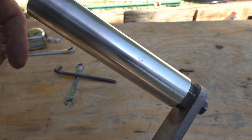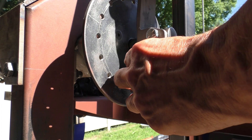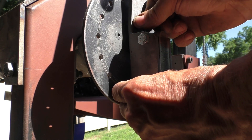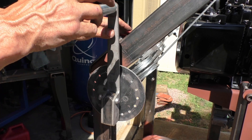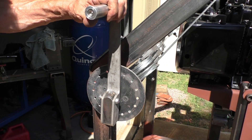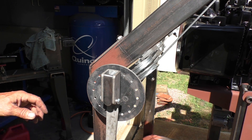That makes a nice spinning handle — makes it easy to turn. There's a hole drilled through the shaft, the handle goes on it, and a little roll pin goes through the top. With the handle installed, the set screw on this end fits into these holes. This part rocks because of the spring — it's pivoting on this part here — so you can push in on it, turn it to where you want your next cut, then drop the set screw into one of the holes to lock it in place so it can't move.